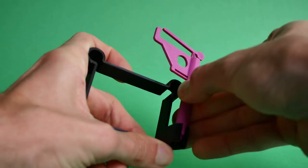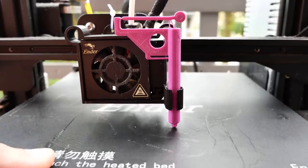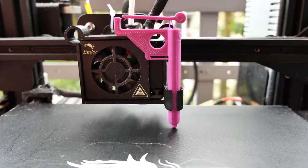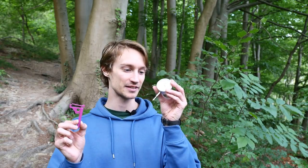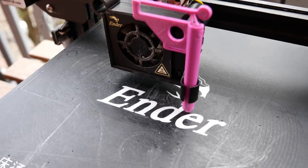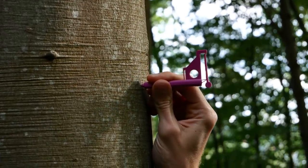But how do you actually use this to get a nice level bed? It's pretty simple. You just attach this to your extruder head and then swipe it along the bed. The indicator will indicate high points, low points, or if your bed is sloping in either direction. Since I designed the stem to be 8 millimeters — just like every other dial indicator stem — you can search the internet for dial indicator holders and find one that fits your 3D printer. Note that the dial indicator only indicates height differences, so you'll still need to set your nozzle at the correct height at one point. Once set, you can sweep across your bed to see if the rest is level. Using a dial indicator like this will also confirm whether you have a warped bed.